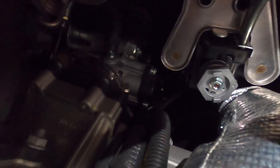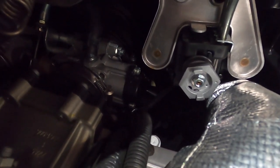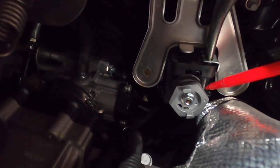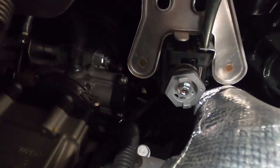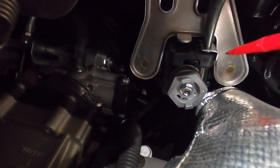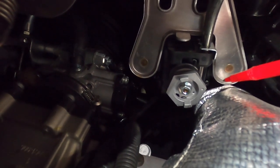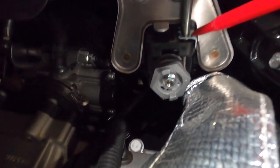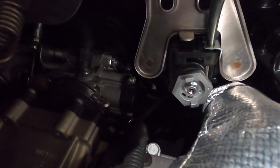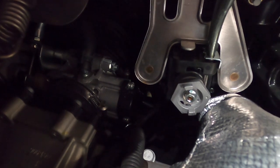Okay, so now we're down here at this 2021. This is one of the ones that got shipped over from Europe, one of the dual rail sleds. This has what I'm going to call the old style, where you have to get the power valve cables out from the backside here. I think it's going to make it much harder. I've never seen one of these pop the cables out before. Look where we are on the new style. We had one in here just last Saturday that had popped the cables out. I first thought it maybe pulled off a metal tab that holds the cables in, but that was still in place and the cables were hanging out. So we're going to show you the new style that Arctic Cat started with in 2020, which I think is what's causing these cables to pop out.